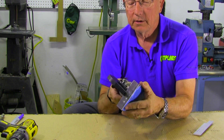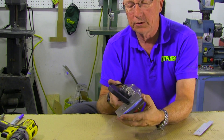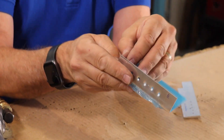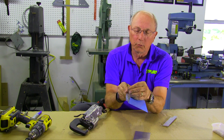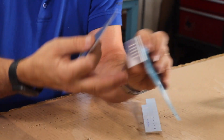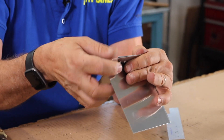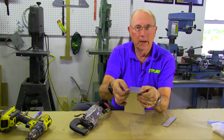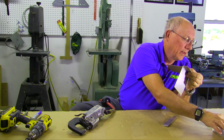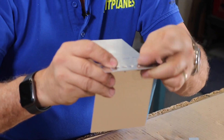We'll take the material that still has the blue plastic on one side. You can do it with the blue plastic on or with the blue plastic off — there's a debate about that. In the end it probably doesn't make a big difference, but you're going to want to take the blue plastic off in order to rivet anyway, so I think it's best to just pull it off early. Now this top piece will sit very nicely down into the dimples. We can click all that together and then drive or squeeze our flush head rivets — it'll be nice and flush to the surface.